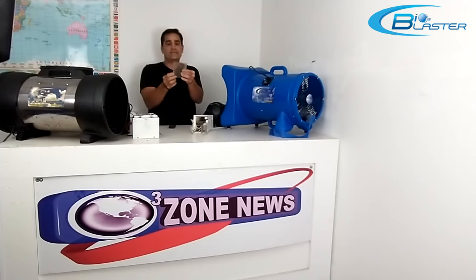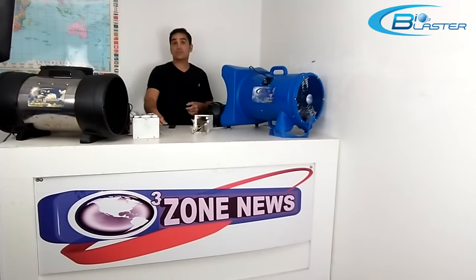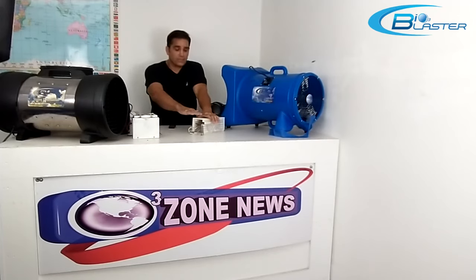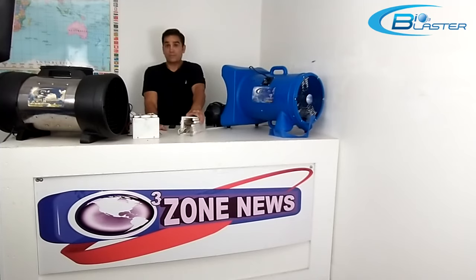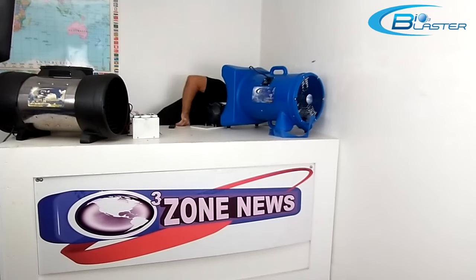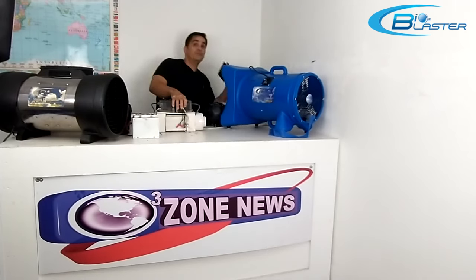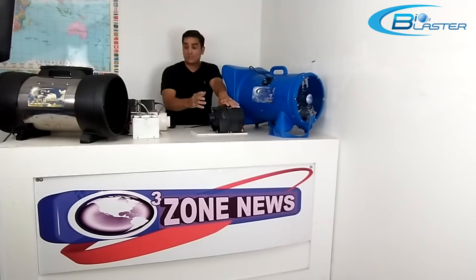The problem with this mica is that it is extruded in flakes with a resin and has a low melting point. So with this type of machine, eventually the mica will burn through and it shorts out the entire machine, meaning you have to constantly be buying new packs. That's still used in a company called Max Blaster today. My very first improvement to the Max Blaster type of technology was what I call the development of my ozone tunnel and the replacement of the computer fan with a heavy-duty serious blower — this is a spa blower.